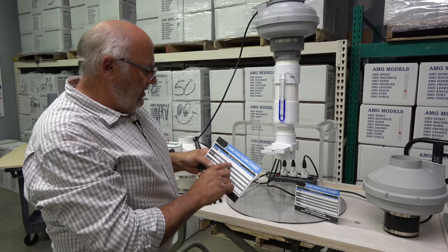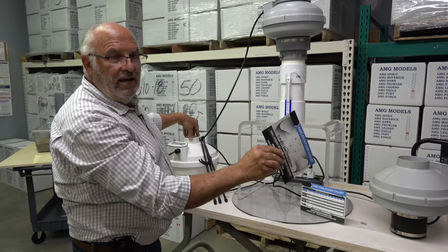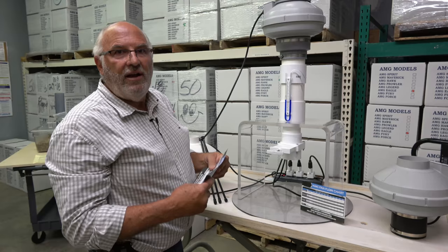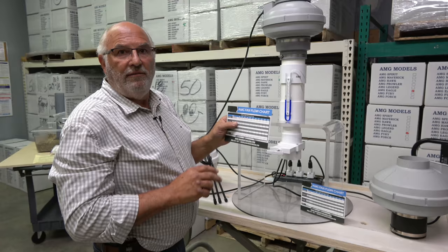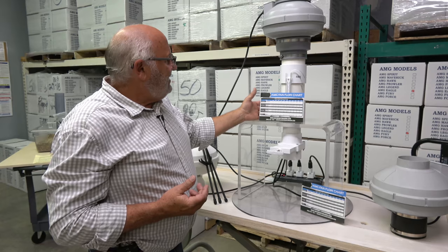What was the better choice? High suction. Both the high-volume and high-suction fans were a better choice than the standard fan in this circumstance, but the better of those two was still high suction. It's so easy if you have this chart in front of you. I answer calls all day from people who say, 'Dave, I've got a problem home — what do you suggest?' I tell them: if you're going to call me, have your fan flow chart in hand standing next to the manometer so we can talk about that first. It's very much overlooked — it is the number one diagnostic tool you can use, but somehow it's escaped the radon industry as far as being taught to mitigators.